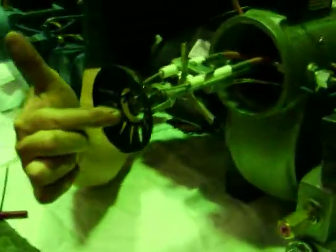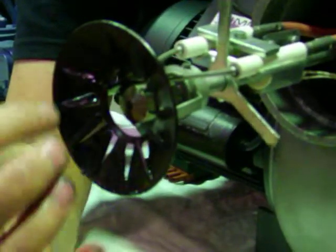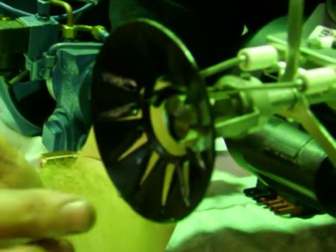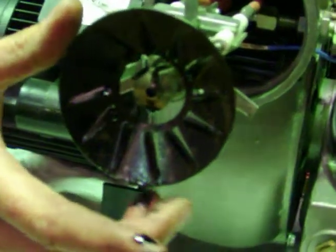This is the business end of the burner. It's this steel nozzle, which is quite large, where the vapour comes out and is ignited by this pair of electrodes sitting above it. It's worth mentioning that you don't want a lot of carbon buildup around here — a lot of ignition problems can be due to carbon buildup, and that's fixed easily by wiping the electrodes. This ring here is called a diffuser ring or diffuser plate, and its purpose is to push the vapours forward and create a spiral, twisting vapour stream which is ignited and produces a spiral of flame.